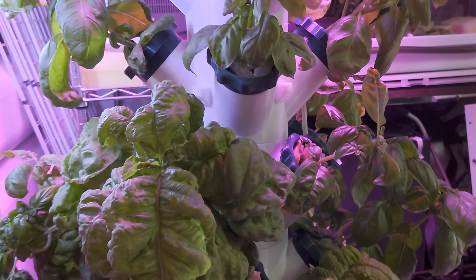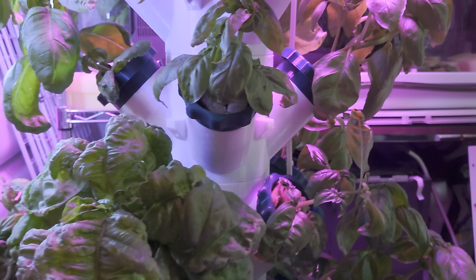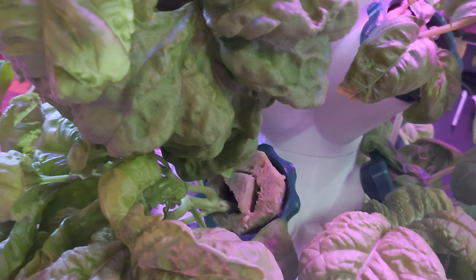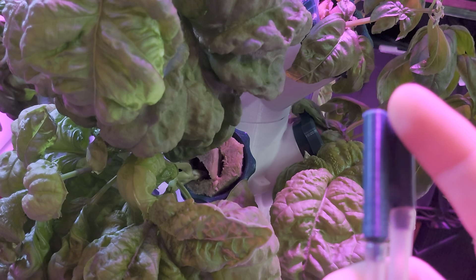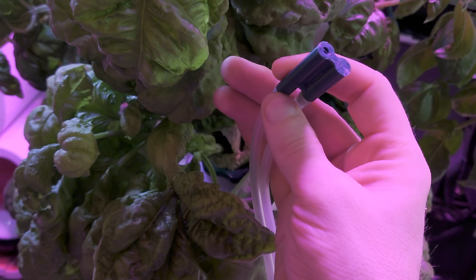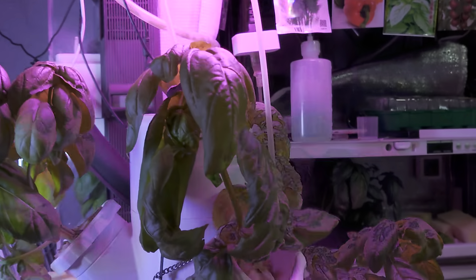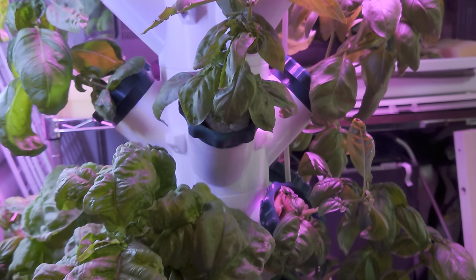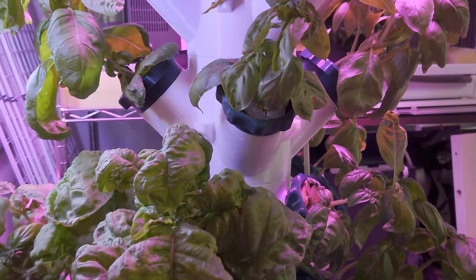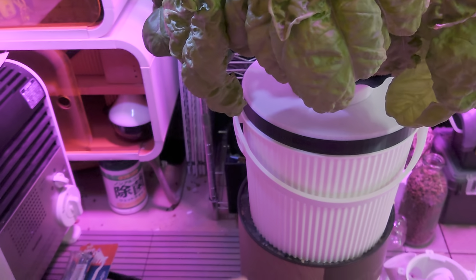In that case we might be looking at around $60 for filament. Then I need to add a pump. I'm currently using an aquarium air pump with a venturi unit — air goes in the short end and out the long end, and it slowly sucks up water. There's a slow drip, which you can see in this tube shaking here. If you don't need a lot of water flow this can work, but for higher volume you'll probably need a water pump at around $15.